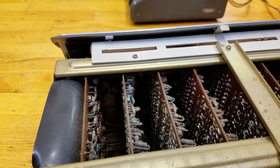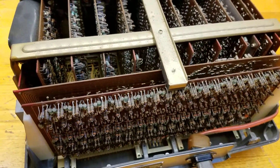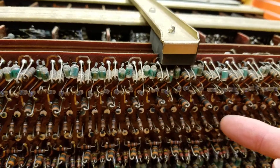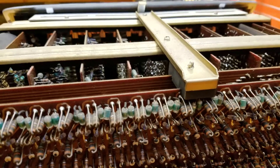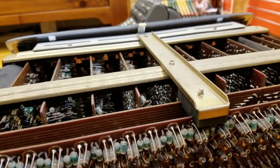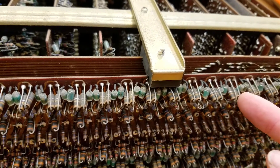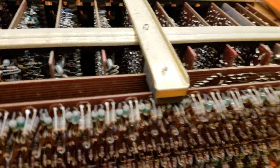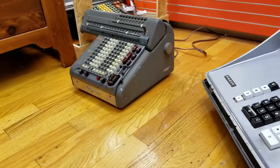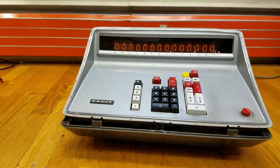Each card has the decoders and flip-flops for two digits. In total there are over 600 transistors and over 1,200 diodes in this calculator. The cylinder components laying down — like the green one — are diodes, while the components standing up are resistors. This was a very expensive and very fancy calculator in its day. I hope you enjoyed this video, thank you for watching.